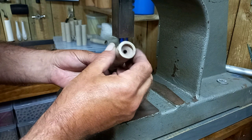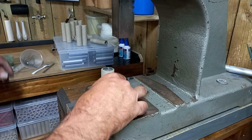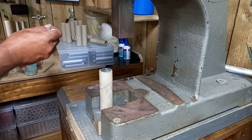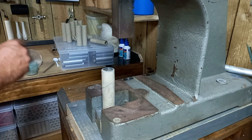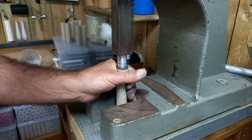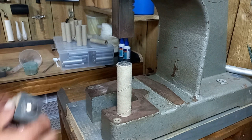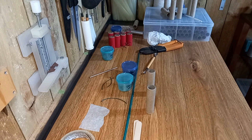If you have a look at the nozzle it's got a bit of a shiny look to it. We've pressed it pretty hard and the wax in there makes it look like crockery or fired clay - nice and shiny, you know it's nice and hard. I'm just going to pop that back on the spindle for a second and put in about a quarter of a teaspoon of nozzle mix. I want to put about a one and a half to two millimetre clay bulkhead in there, which I'll later drill a little pass-fire hole in so I can put a charge above the fuel level of the motor. There we've got that put in - pop the motor off and there we have the finished rocket motor.